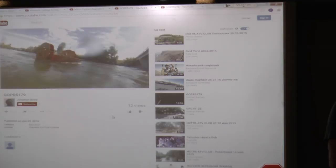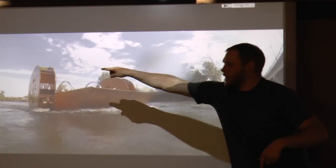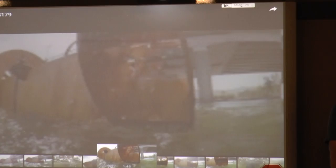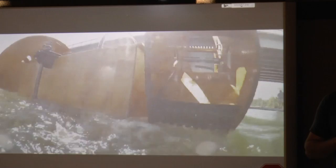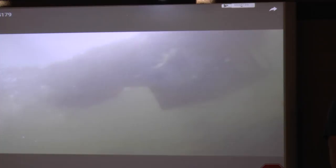Here's a walk-around with the barge spinning on its own with a GoPro camera. As you can see, it's flowing pretty well, but you can see how the water is hitting the barge and going out around the paddle wheel rather than channeling in. We think a V-nose shaped barge would filter that in a little better. You can see the corrugated pipe scoops helped out — more surface area holds the energy a little bit longer, providing more force. But it was hard to combine both the paddle wheel and turbine technologies and get them both working at the same time.